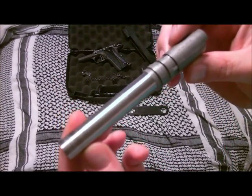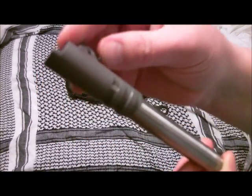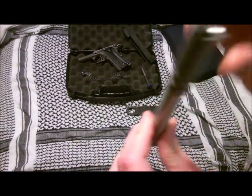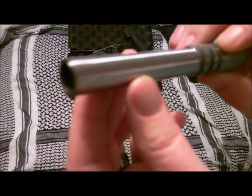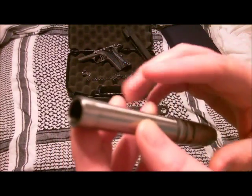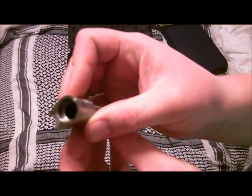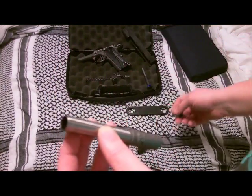This is a barrel for a 5-inch government that was hand-fitted to my gun by Lloyd, a great gunsmith out of Coeur d'Alene, Idaho — or actually I think he's out of Rathrum. This part is swollen up and they fit this piece to your gun and to the barrel so that they're tight. That's where the accuracy comes from.